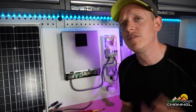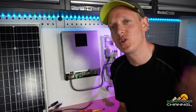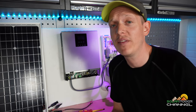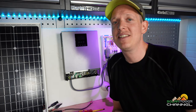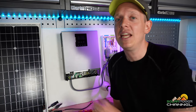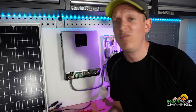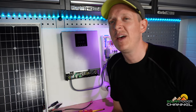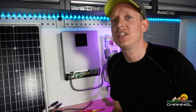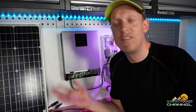This all-in-one unit I got from Volticon Solar — I'll leave a link below. They've got quite a few in stock, ranging from 12 volt up to 48 volts. If you buy anywhere else around the world, be careful — very sneakily it'll often be a PWM solar charge controller inside, not MPPT. You really want to pay the extra to get the MPPT solar charge controller. I've done a video on the difference between them, but go for the slightly more expensive MPPT — it'll be a lot more efficient at capturing sunlight and pumping it into your battery.